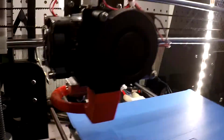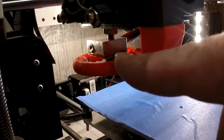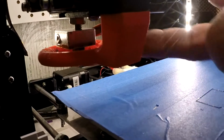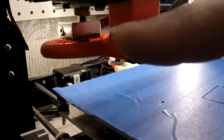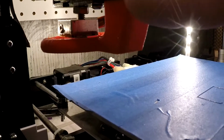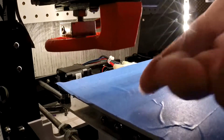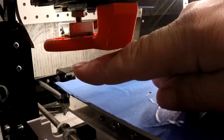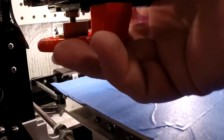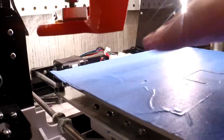Then on your extruder, you'll notice you've got a little white piece that comes off and it barely comes to here. Print yourself a cooling ring. This is a big plus on the Anet A8. Another tip, you're going to want to super glue it into here. Don't panic. Every now and again the heat will get to it and this will slope down a little bit, but all you have to do is let a little heat get onto it and just pry it back up. Every now and again it'll go down. You'll see it tilt down a little bit.